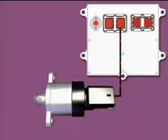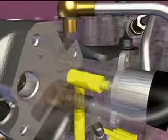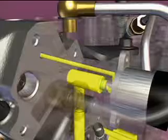The fuel pump actuator receives a pulse-width modulated signal from the ECM. This fuel pump actuator controls the amount of fuel metered into the high-pressure pumping chambers. Controlling the fuel flow into the high-pressure pump prevents pressurizing more fuel than is needed. This actuator is a normally open valve. Current is increased to reduce flow to the pump, thus lowering fuel rail pressure.